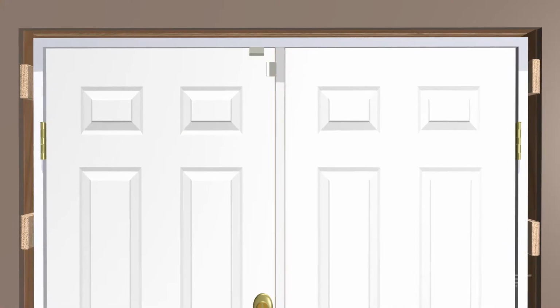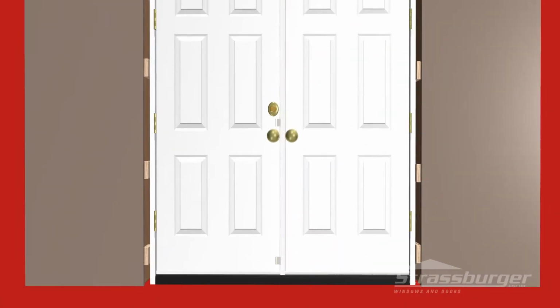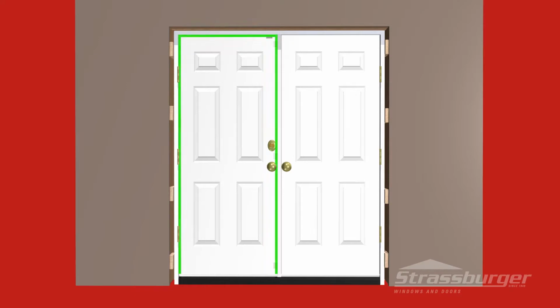At this time, check the top corner of the lock side. You will notice 2 shipping spacers, one at the top and one at the side of the top corner. There is also a spacer below the deadbolt as well as at the bottom of the door. All spacers should not be removed until the door is correctly installed and operational, as these spacers act as a gauge to maintain the 1/8 to 3/16 even space that is required.